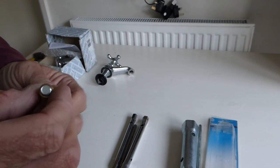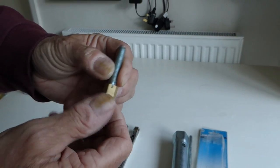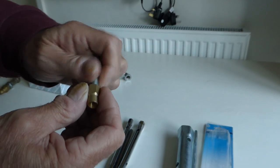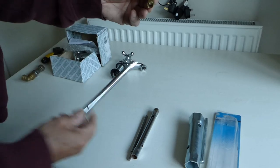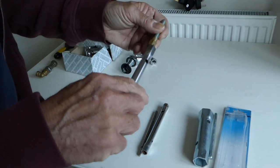Tool number seven: this piece of kit is invaluable if you've got monoblock mixer taps. Indeed, if you've got bath taps and the basin spanner won't undo them because they're really tight — the back nut on the back of the bath or basin is really tight — you need a box spanner. This is especially for monoblock mixers where you have a small nut on the back of the tap and nothing will get up there because the pipes are coming down in the way. So you first look at this and think it's an impossible job, but this is the tool for it. Here we have a typical nut you would get holding monoblock mixers in — you won't be able to get a spanner on there because they are just too far up and you can't move a spanner. You've got to use a box spanner. These nuts come in all different sizes, so you've got to get the right one.